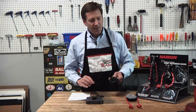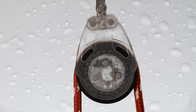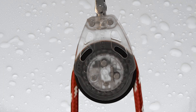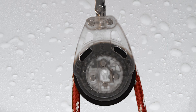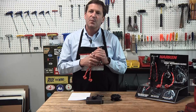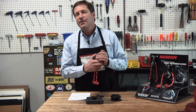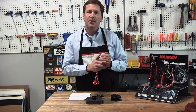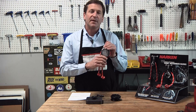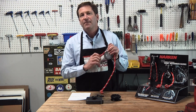With a ratch-o-matic, or an automatic switching ratchet block, it is preset to a line load that engages the ratchet mechanism. That is used in a system where the line load for holding is always going to be more than someone would want to hold for an extended period of time. But when it comes to releasing the line, you want the line to run very freely.